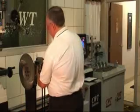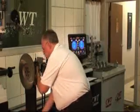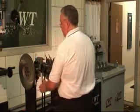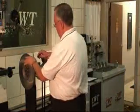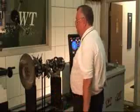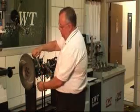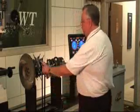The next thing we're going to do is add our third piece in place — you notice I had rotated the crank around, and everything is lined up. One of the reasons we use these guide pins is to ensure that we maintain the moment center. Back to the hardened pins: what we do is ensure that when we capture the bob weight onto the journal, we just want to cinch it in place so it doesn't move. We don't want to over-tighten and cause distortion. Calibrated nuts are used to try and ensure that the parallels will stay the same — it's pretty hard to over-tighten and cause deflection.